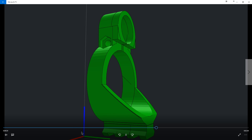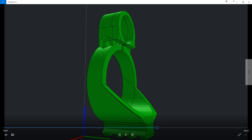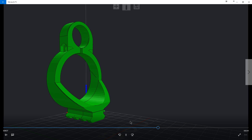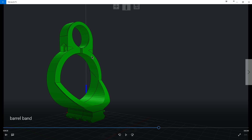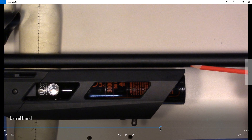This is the actual first piece, and it's important we talk about this because this was that goof I mentioned. In my very first design I put a shoulder right here, and that shoulder was to keep the shroud down so it stayed even. This ended up haunting me. This is the redesign — notice the shoulder is gone, I eliminated it. Because what was happening is when the rifle was sitting on its bipod or in my hand, the shoulder was transferring movement directly to the barrel and changing the point of impact.